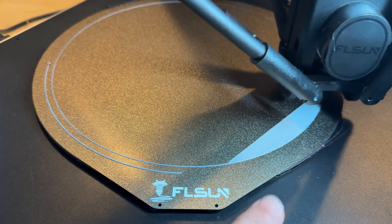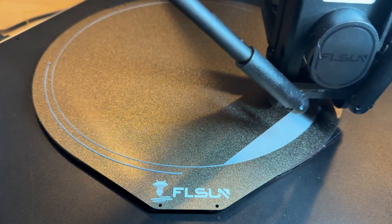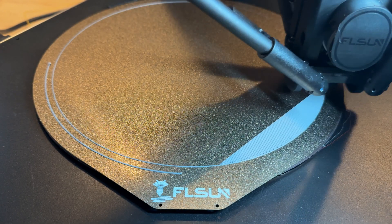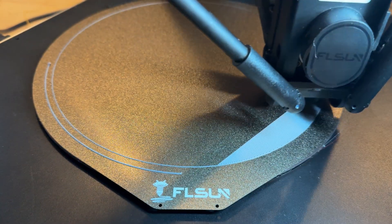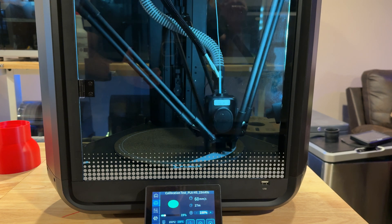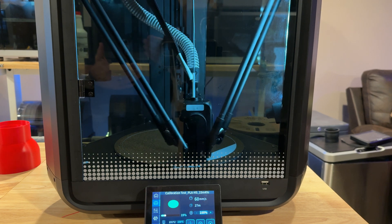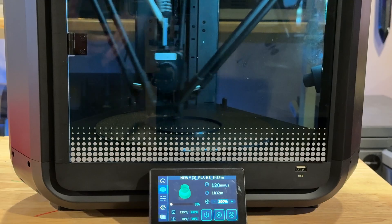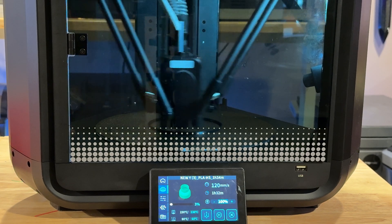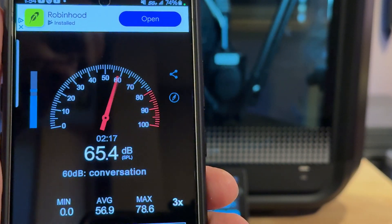Let's pull back and let the printer continue to run to get a sense of the noise. The fans aren't spinning up much right now because it's running at 60mm/s; once it speeds up the fans get louder and the movement noise kicks in. I'm going to put the phone very close to the T1 Pro and then bring it toward the camera so you can hear the difference. We're running at 70 to 260mm/s for that production job — about an hour and 30-something minutes — at bed temp 55°C and nozzle at 220°C.